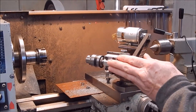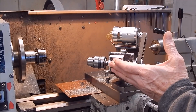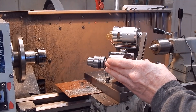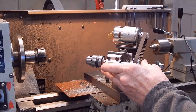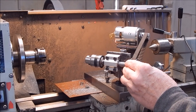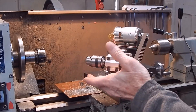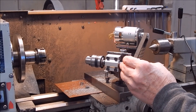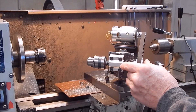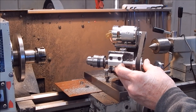Well, there you have it — it's not bad. I'm surprised how powerful the little motor is. Up to 5mm drilling through solid steel, it should do that okay with a good sharp drill. But you can go bigger than that if you just step your way through — you could go 6mm easy, maybe 7 or 8, if you pre-drill so that the motor's not being expected to cut a hole into solid steel. And you'd normally do that if you're drilling anyway — you'd normally work your way out.